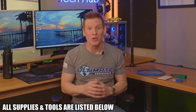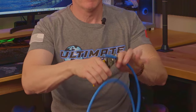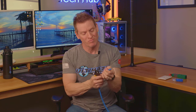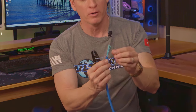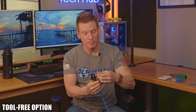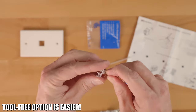So here are the supplies and tools you're gonna need for this installation. And everything is listed in the description below. So first, you need to strip back about 2 inches of the protective sheath of the Cat6a cable. Next, you wanna reveal all the wires, then cut off this plastic inner core. So there are 2 installation options, a tool-free option or a crimp tool option. We're going to show you how to use the tool-free option.